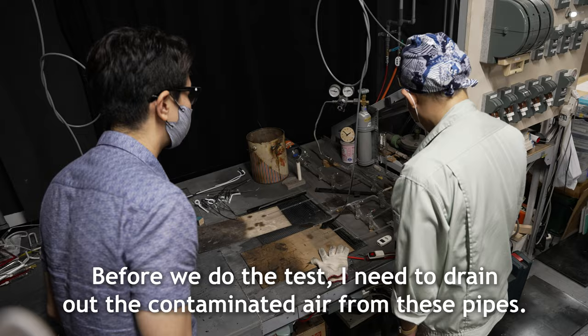With the light test successful and the argon gas vacuum sealed inside, there are just a few more simple steps to complete. To make the neon sign presentable and usable, it will now be mounted onto a small acrylic box. Not only will this allow the sign to stand freely, but more importantly, it houses the electrical components required to power it. Every sign is different though, and each one requires its own bespoke mounting solution.